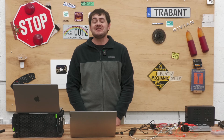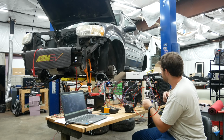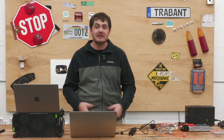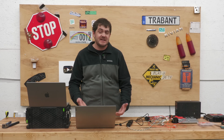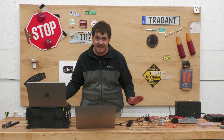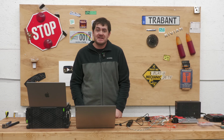In that clip, I did exactly what that paragraph warns against. I did key off, which was the wake input, and then before the VCU had turned off, because it was seemingly frozen, I disconnected 12-volt power and apparently corrupted the memory. After that, when I turned the VCU back on, all the configurations were randomly flipped all over the place. And the VCU was never the same again.